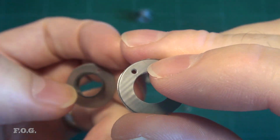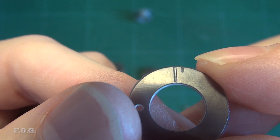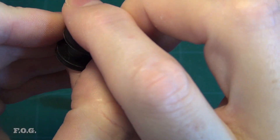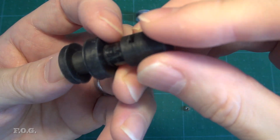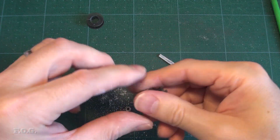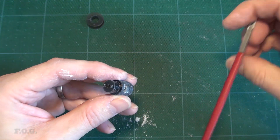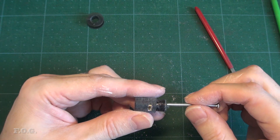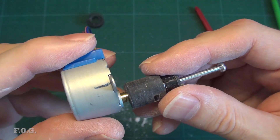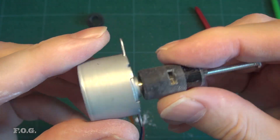For the other piece of the bobbin, I was even able to print the wire slots into the surface. I actually had the holes for the wire in the original design too, but the elephant's foot likely made them disappear when it printed. Let's do the rough fit check. The bobbin is installed in the bobbin holder and the locating holes are aligned with the locating pins. Here is where the main shaft locks in place for the two pins. Now to file out the slot for the retaining nut. Even though the span of the bridge seems pretty tiny, as this is resin printing any horizontal bridging will sag — the thin layers actually get sucked down as it prints. I would have preferred to use thread inserts, but they just don't work with resin prints. I've tried. Anyway, this solution works good enough. For the stepper motor shaft fit check, I need to back the screw out a little bit to make space — otherwise no problem, a pretty snug fit, no adjustment required. Very nice. This piece is interesting — I actually printed my own servo horn. Even though the servo shaft has these really tiny splines, I was still able to get a perfect fit. Unfortunately, the tiny wire hole did not make it through the printing process, so I need to manually drill that out.